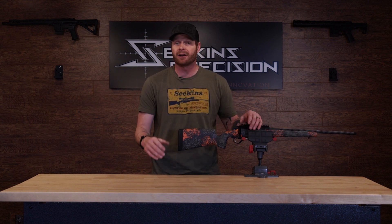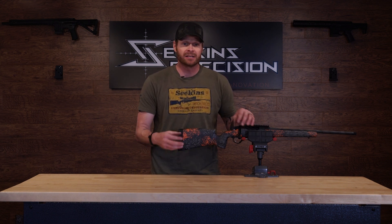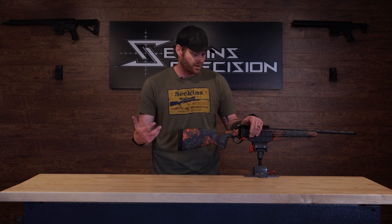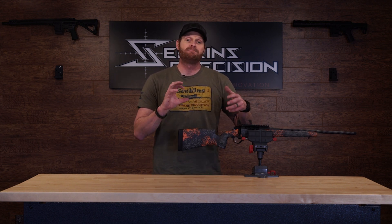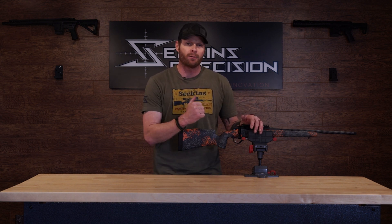This is a quick, down-and-dirty guide on how to take it apart, clean it for field expedient cleaning, and get it back together so it's ready to go — whether you're out there dealing with a big sandstorm, dust, grit, wind, or wet conditions and you need to take that bolt apart and clean it up. We're also going to cover a couple of different ways to get your bolt back into the correct position should it happen to slip into the fired position and not want to lock back up.